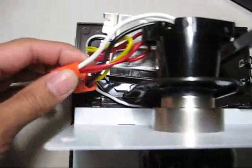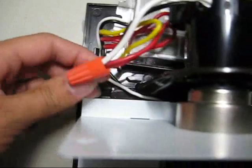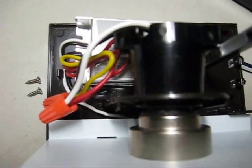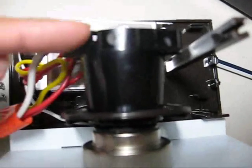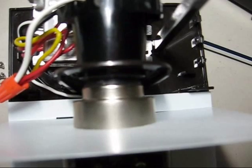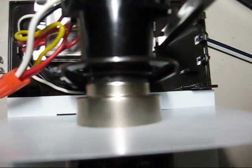Now, in order to get this to work, I had to parallel the two red wires coming out of the ballast, and then just the yellow wires hooked up to the other terminal. I tried it with one red wire before, but it only ran this lamp at 13 watts instead of its full 18 watts. I originally didn't have this BY-22D bayonet socket, so what I did was I just soldered a few pieces of wire directly to the contacts on the cap. But since then I've now gotten the socket for it.